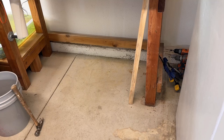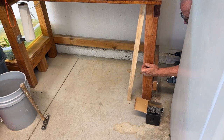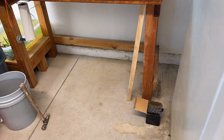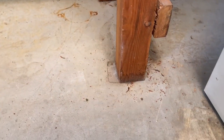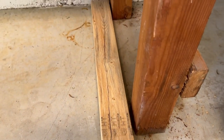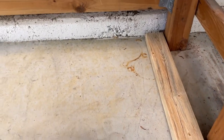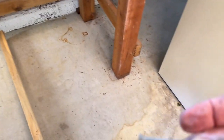It's going to be some sort of odd trapezoid-y old thing. There's the old mark. I've got this 2x1, so it's going to be a little more squarish and the frame will slide in there. I don't want to screw it to the sides — I just want to slide it in. I might have to shim it to make it level because I don't know how level the floor is. There'll be one there, one on that side, probably one or two in the middle, one across the back, one across the front. I used these 2.5-inch deck screws.